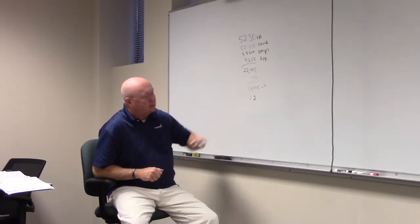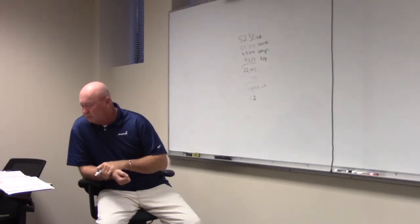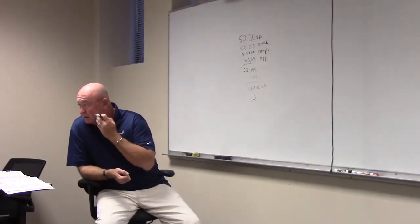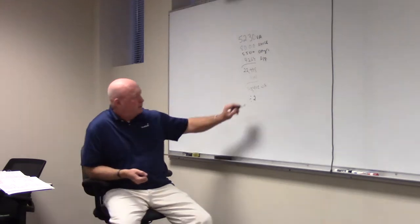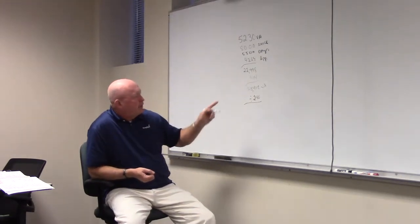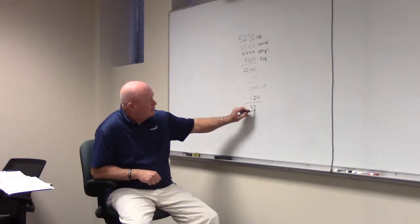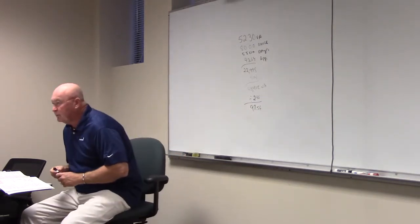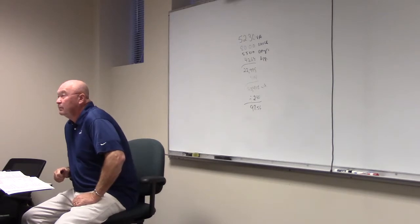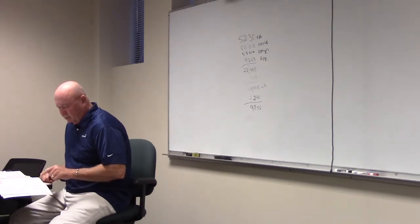Divided by volts, which is how much? On this dwelling, how much is it? What did it say it was? A house is 120? 240. So 23,412 divided by 240 is how many amps? 97.56. What is our minimum size service going to be? 100 amps. Okay? 100 amps. And that's what's required.